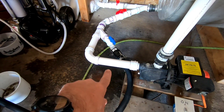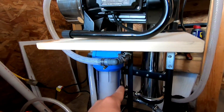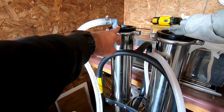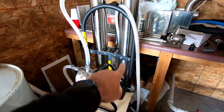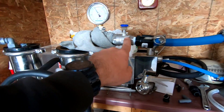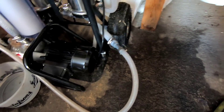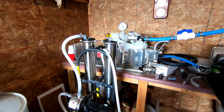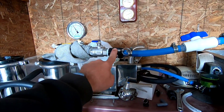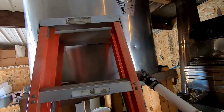You can see when I open it, it lowers, and when I close it, it raises. It's been running pretty good right around that 120 to 125 PSI mark. Now, how this is plugged together is: sap comes out of the bulk tank and it runs through this one-inch line into the lower pump. It goes through the first pump into this filter, and then it comes out of this filter into the second pump. It comes out of the second pump and goes into the top of this membrane. It shoots down through this membrane, and they run in series out the bottom. It comes back up the top of this membrane, and then your concentrate flows out right here. The bottom right here is where your permeate flows — which is your pure, clean drinking water.